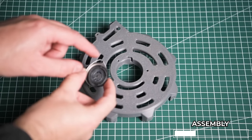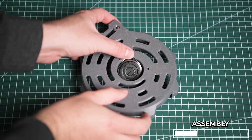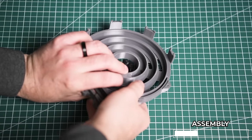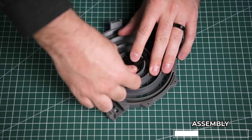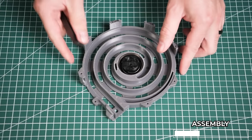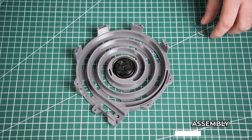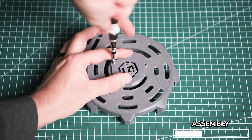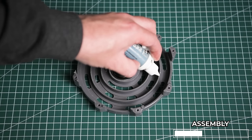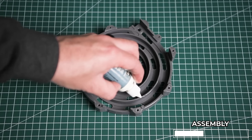Now moving on to the front of the drum, you need to position the spring hook into the slot on the drum, and then place it on a flat surface. Push the wire strap down and off to release the drum spring into the drum. For this step, I would definitely recommend referring to the pictures in the PDF format. Once the drum spring's installed though, screw on the front logo plate, and just like with the rear half of the drum, apply generous amounts of silicone oil to the edge surface of the spiral.